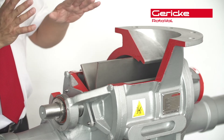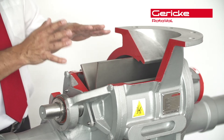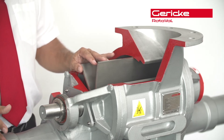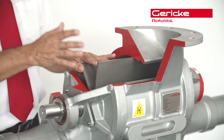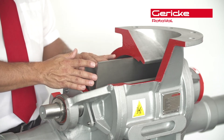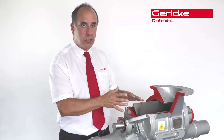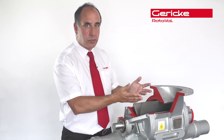With any type of leakage, you need to know the system details. The lower the pressure, the better chance there is to reduce the actual leakage going through the valve. Any valve that has a head of material will act better as a buffer for leakage air. If you are underfeeding your valve, the air will permeate through the clearances greater than it would with a head of material.